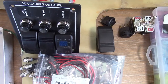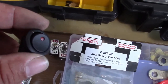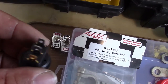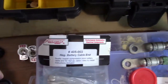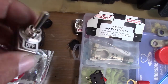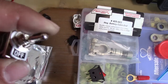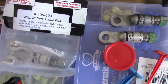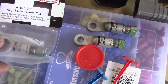These are the style switches I choose to use — they're probably about the same cost as a lot of aircraft switches people want to use, I just prefer this style. We also have switches that I think people should not use, like these little guys — what I used to call car audio switches or Radio Shack switches. They're probably okay for low-voltage stuff, but I wouldn't use them for much in an airplane. These other super solid, really good switches are kind of heavy and they're not lit, which means I'd have to run an LED — which is fine, but I just don't like them.